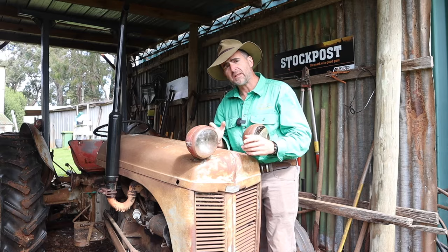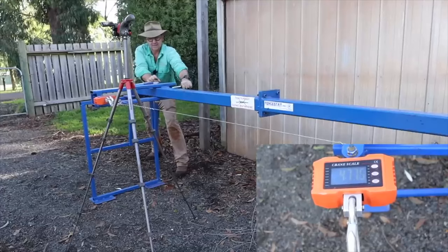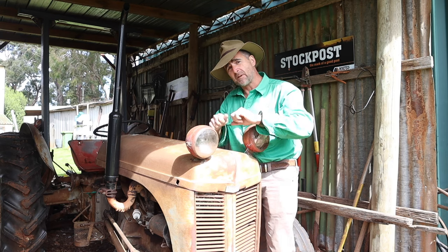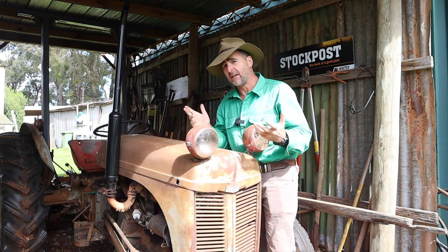If you stretch high tensile wire too much, it becomes brittle and breaks because of all the carbon bonds, whereas soft wire is much easier to tie off, and if you kink it, it doesn't break.